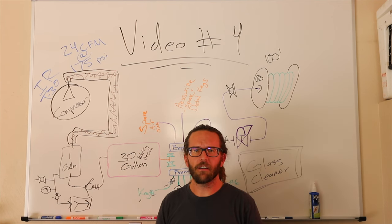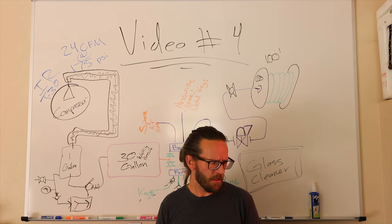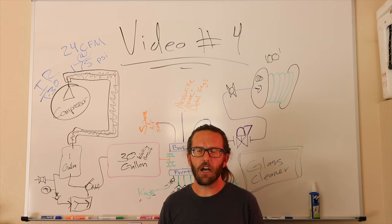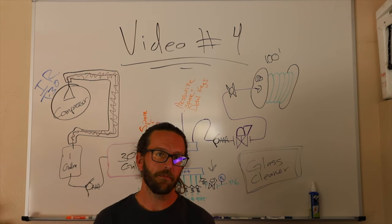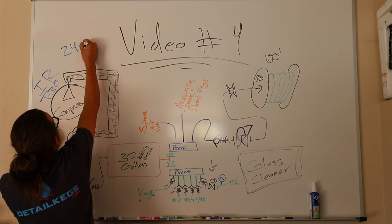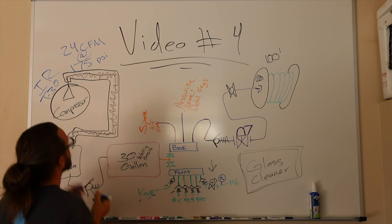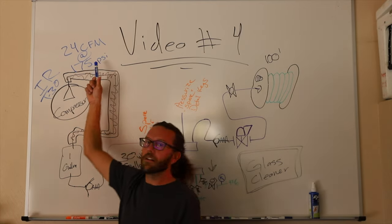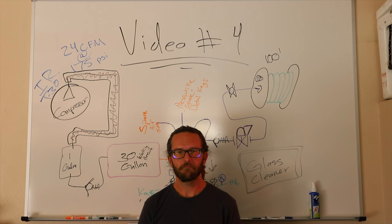As you can see, I just went out there and I fired it up, and it hasn't started for weeks now, probably. Well over a month, right? It's first kick, pulling it. Second kick is electric start. Highly recommend electric start, generators, compressors, all that stuff. The compressor itself is an Ingersoll Rand T30. Okay, it does 24 CFM at 175 PSI. That's no typo, okay?